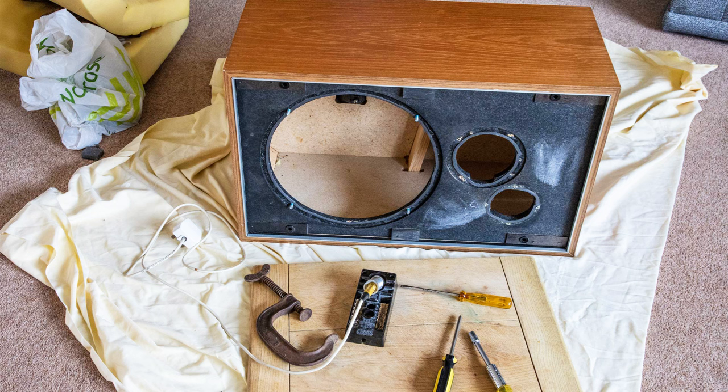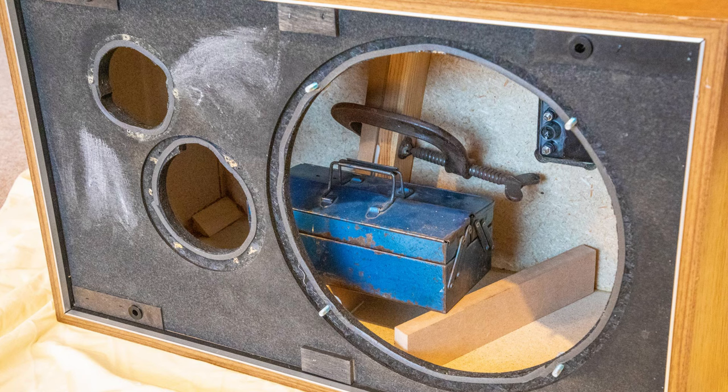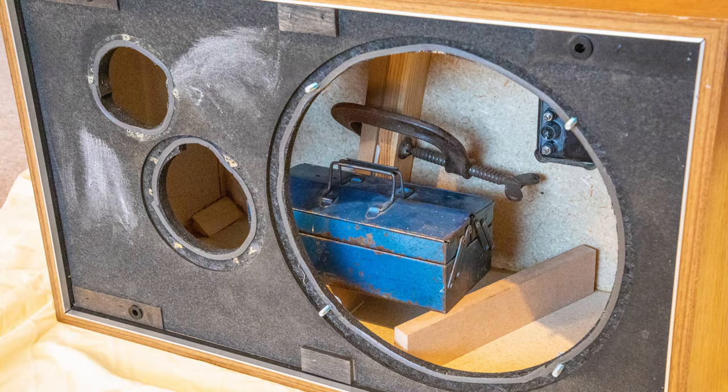I had planned how to provide the best reinforcement I could, thinking about where additional reinforcements were needed given my limited access. I cut the strips to length, though they still needed a little extra work to fit as snugly as possible. I glued the new reinforcements in place and used a clamp where I could; otherwise I used a weight, and a small socket set was very useful for this. I added one brace alongside the existing strut on the back, as the relatively lightweight wood used there was not so effective. Much denser woods or MDF, which I used, seemed to be recommended by many.